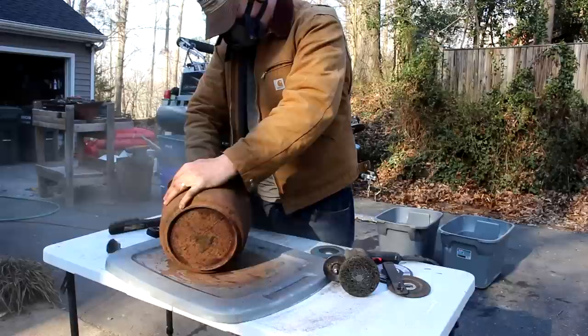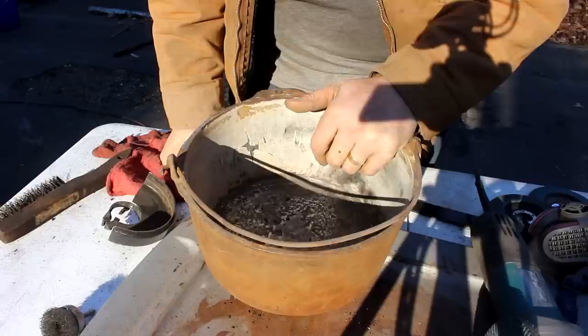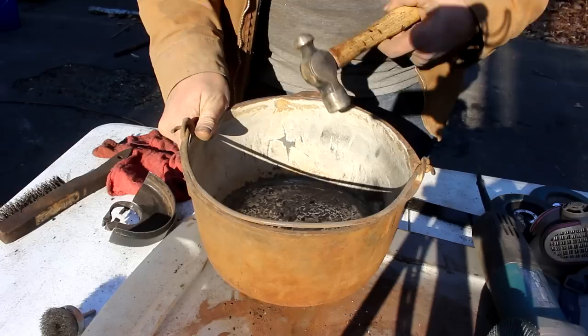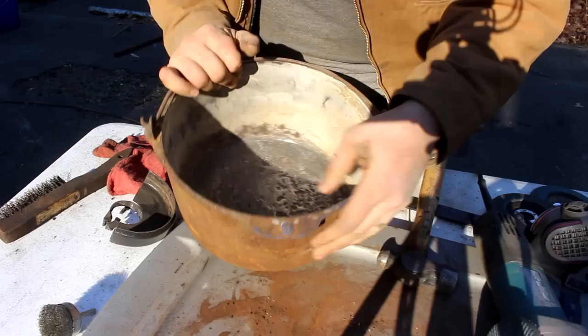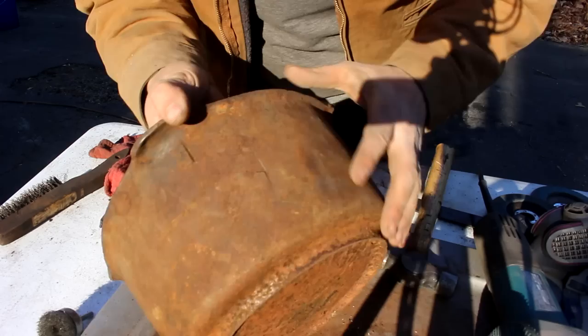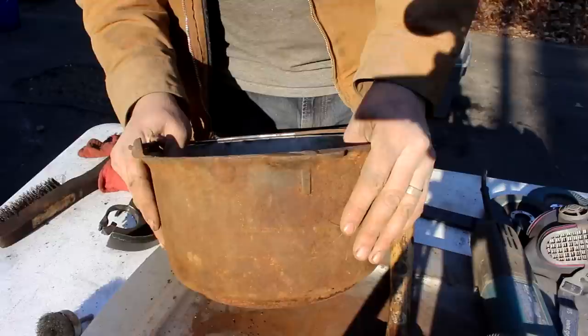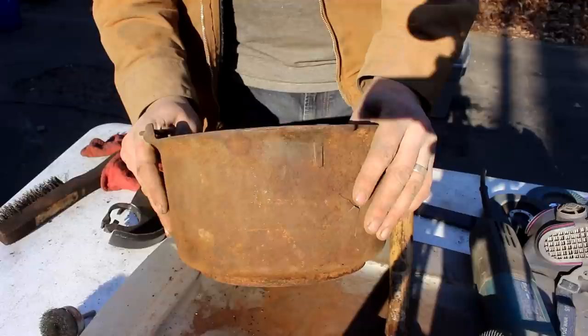Well, I did something stupid. I was grinding away at this enamel for an hour and made very little progress. I thought maybe I could speed it up by gently tapping it with a ball peen hammer to chip away the enamel. Even being extremely gentle, I busted a hole right in the cast iron and it cracked all over. This pot is from the 1800s and I just broke it. Learn from my mistakes: first, don't try to buy antique pots with damaged enamel linings — they are a pain. Second, don't try to knock the enamel off with a hammer.